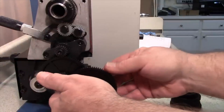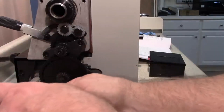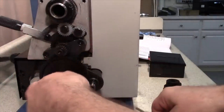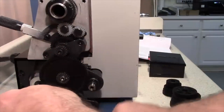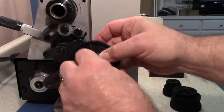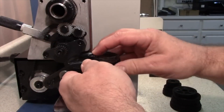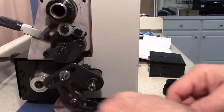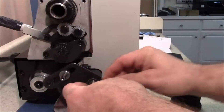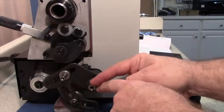On a brand new lathe these gears are often on very tightly and need to be pried off gently with flat-bladed screwdrivers. The other gear position has two gears that come off together, held by a little sleeve. You also have to be careful not to lose the small spacer, which is used for various gear combinations depending on whether the gear needs to go in the inner or outer B or C position.